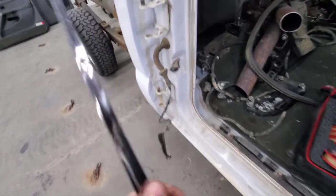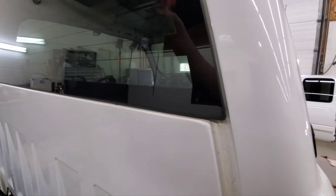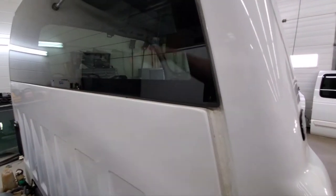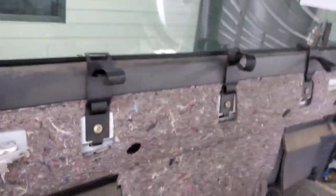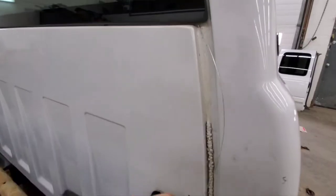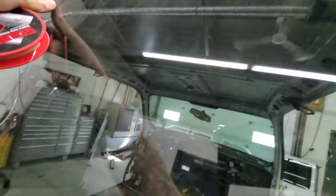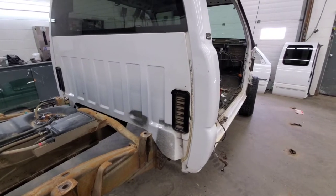It comes with this little pick. What you do is from the inside, find a place where you can push it through. You push it through — there's a hole in the end — and you feed the wire through it and pull it out. Pull about four feet of it, which is what you wrap around the Python itself. Then you wrap it around the glass. You've got this handle. It comes through to the other side and you feed the wire through there, hook it around, and pull as much wire as you need — about four or five feet — enough to wrap around the tool itself. The wire on the outside you do easily with one hand, just tuck it in behind the glass and go all the way around. I'll show you the trick that I do that makes it a little bit easier than the way they want you to do it.